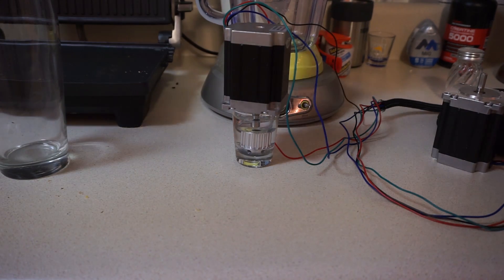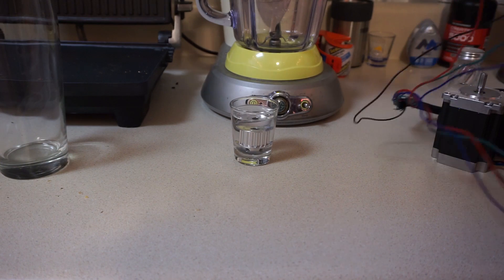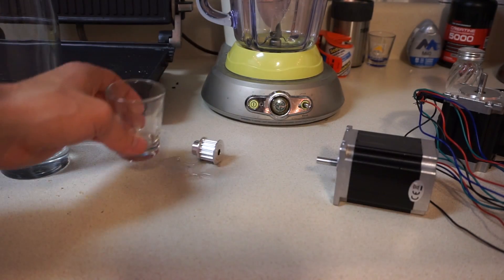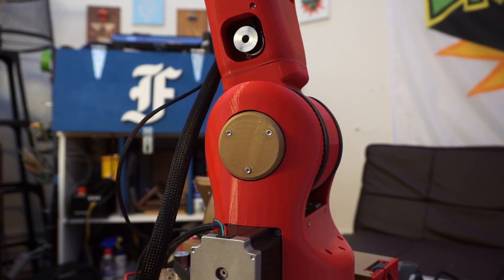The problem didn't quite stop there. It took two goes at applying the Loctite. On the first time, the glue dried before the pulley was fully seated, so we had to use acetone to remove it and then reapply the Loctite. And now we're currently not seeing any slipping.